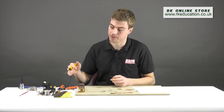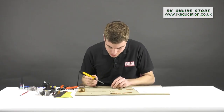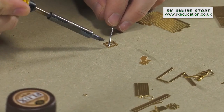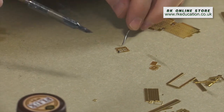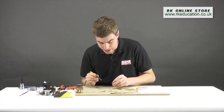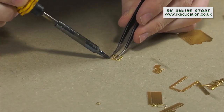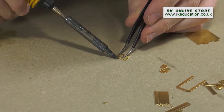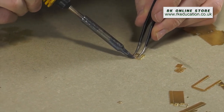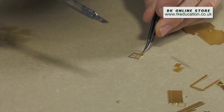There are a variety of solders on the market — some with a flux core, some without — but if you're already using flux it's irrelevant. I'm going to approach the iron and the solder at the same time on this component, starting on the top right-hand corner. With a tiny bit of heat applied, that's one corner tacked into place. The part has lifted slightly — this is called a tack. We can now refine it by applying downward pressure with the tweezers and reapplying heat to move the component into place.